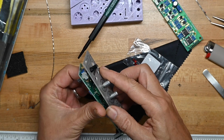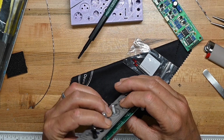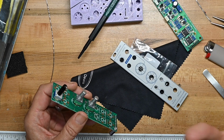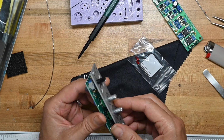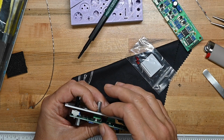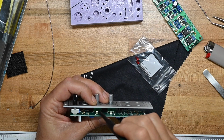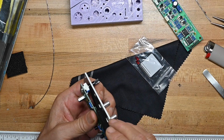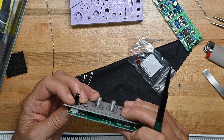Now I'm going to put this on here, and I'm not sure that I wasn't correct before. Because when I look at eurorack and I'm mounting the control panel, or the faceplate, to the front panel, one component drives the distance, the tallest component in the panel. In this case, right now, that's these blue body color potentiometers. The blue ones still have a good bit of play. We could go another 3/16, I don't know, a lot of distance.